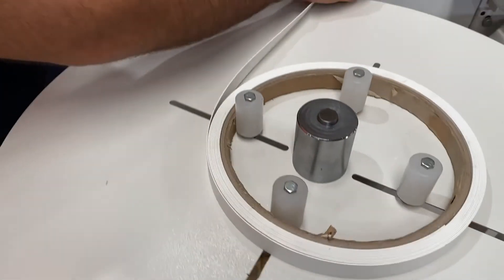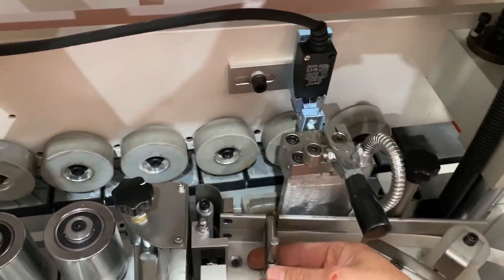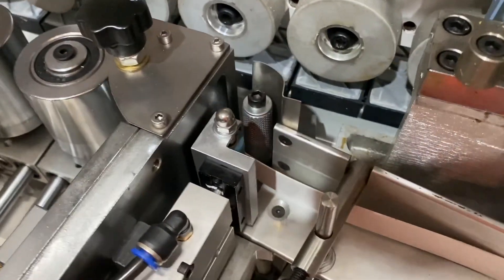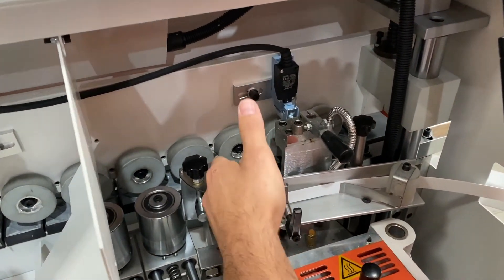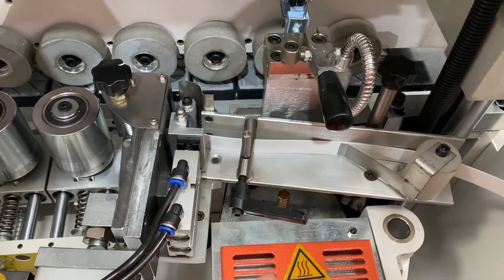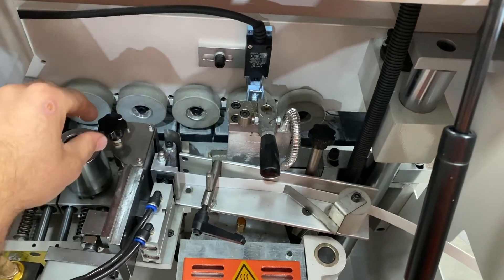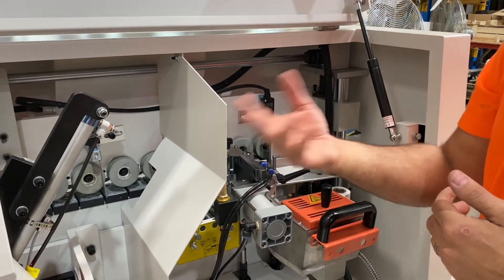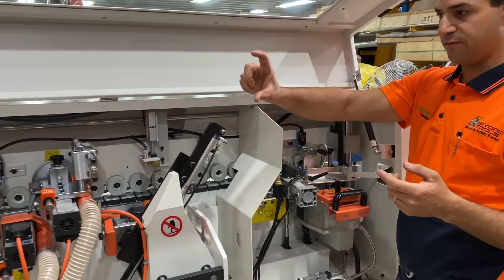To feed your edge tape, feed it through the little hole here and then through this little roller down here. You may need to lift this up and then it will go in between the two rollers. We want to start it at the guillotine here — where it cuts is where we want the front of the edge. Then lower this edge strip guide down about one mil and do the same with this one here. Screw it down till it's touching the tape and the tape's tight, then back it off about one turn so the tape moves through nice and smoothly. If the tape doesn't move through smoothly it won't feed each piece through ready to accept the next panel. If it's too tight it won't feed through; if it's too loose the edging will ride up and won't feed onto the panel properly.